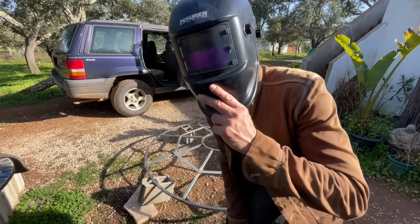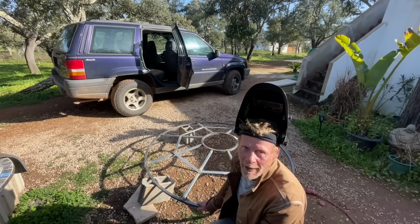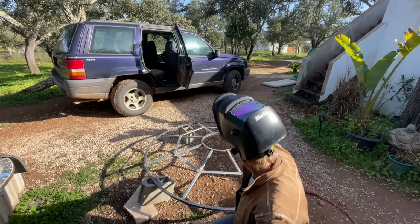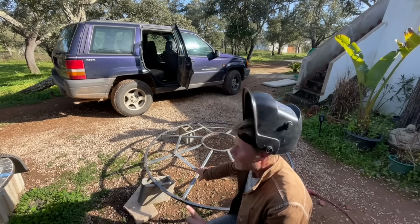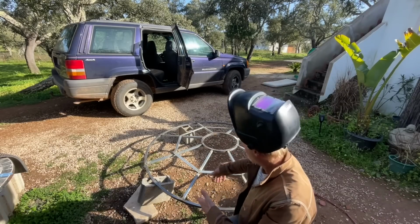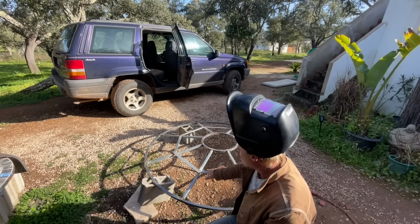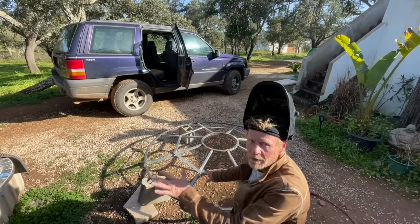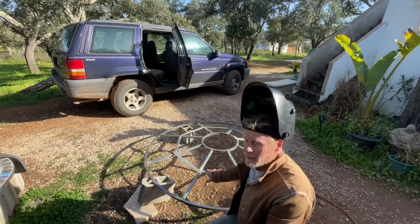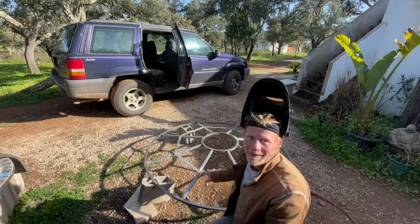Hello. Right. We've had to wait a couple of days because we've had quite a lot of rain. But before it rained, I managed to get these bars going around here. One of them, though, I have to move because I realise I'm going to have a pump going down. I want to leave as big a gap as possible. So I'm going to cut this off smaller, put it back on here, weld it, and then see if I can go around the lot anywhere that's loose, re-weld, sand it down and get it ready for paint, leave it overnight, and tomorrow we'll put the netting over it and then down to the well.